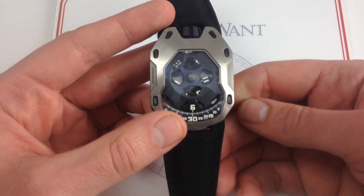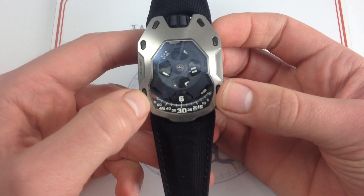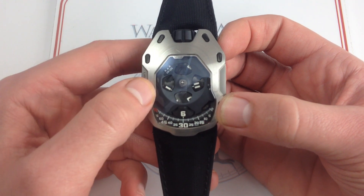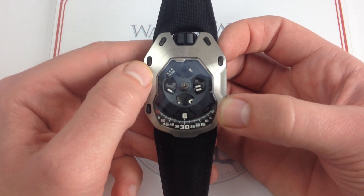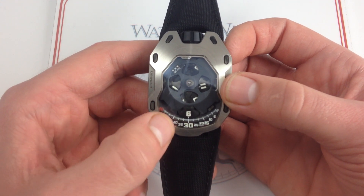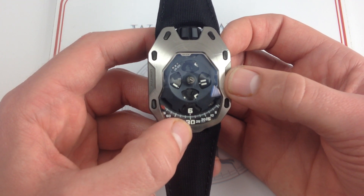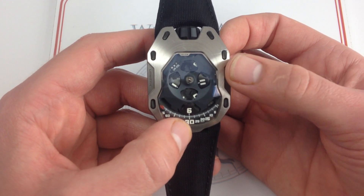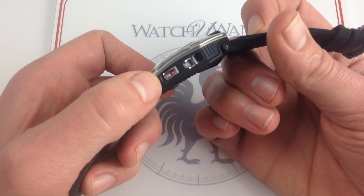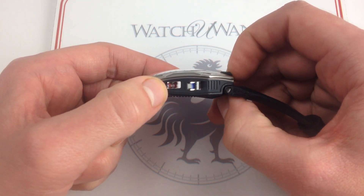These four individual hour disks make one complete circuit of the dial every four hours. Each disk features four separate numerals, and in an innovation unique to URWERK, scrolling constant seconds on a barrel indicator. You may recognize this time display from the Audemars Piguet Star Wheel watches from the 1990s and early 2000s. The key distinction — and the wandering hours concept was pioneered centuries before either URWERK or AP — is that URWERK uses a much more precise and robust Maltese Cross changeover system to circulate the hour disks, whereas AP uses a system of star wheels propelled by springs. URWERK's system is more suited to a sports watch and features a constant seconds display that AP has yet to adopt. You can hack the balance by pulling the crown, stop the seconds, and synchronize precisely to a reference timer.